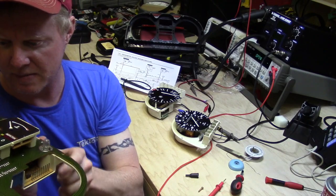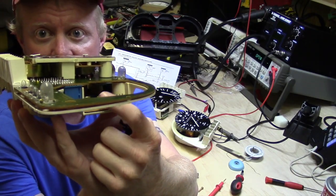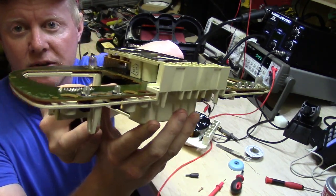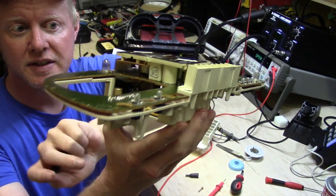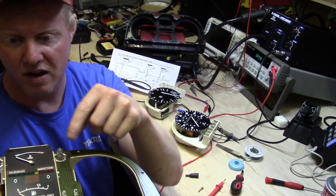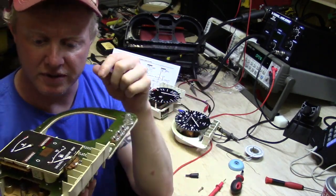One of the things I really don't like about these designs is all of these modules slide in and actually connect via these pins. The pins aren't necessarily always straight, and they're really prone to getting corroded. Just the feeling of them, you can feel the dust that's actually on the connector itself. Although the gauge set is really, really clean, the bulbs and the board and all of the connectors are really dusty.